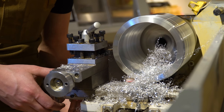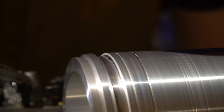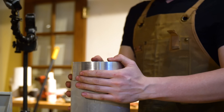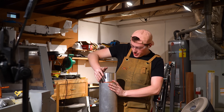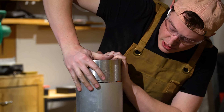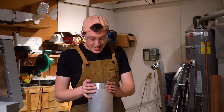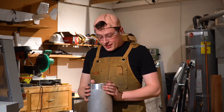After the inside was done, I started turning the outside of the carrier — first the slot that the liner fits inside, then the first O-ring groove. I tossed on one of the O-rings and checked the fit with the case. After turning the second O-ring groove, I checked the fit with both O-rings. It's in there. Honestly, it's a pretty good fit — I'm feeling all right about this. I feel like it's gonna seal.